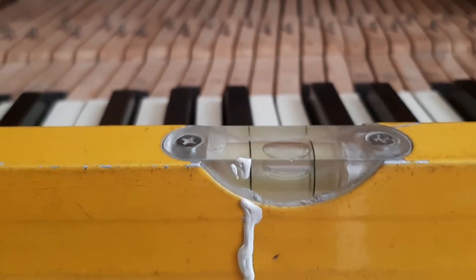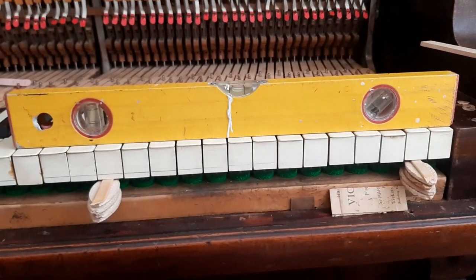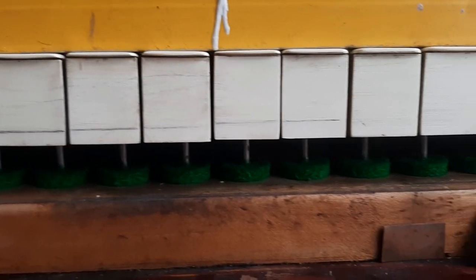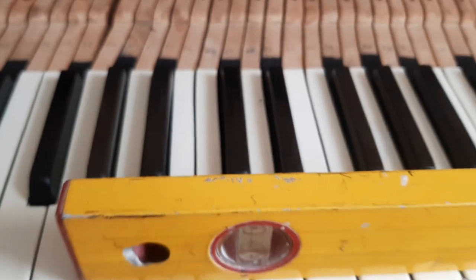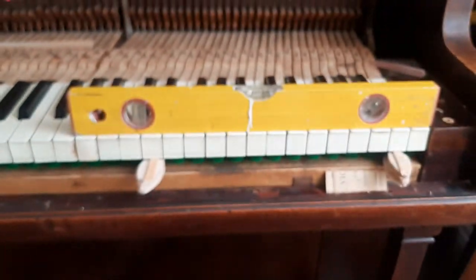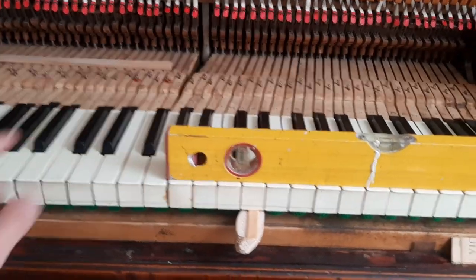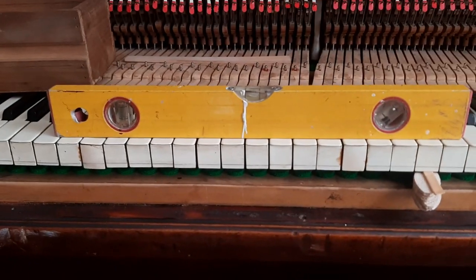So when it's on those two, it's not smack in the middle, but it's still between the two lines there. So after the first leveling and much more accurate process, you can see I've got them all perfectly aligned. That's the first about 20, and then what I'm going to do is leave this one in here and then put this in another key, for the length, and proceed like so, and then balance them, and then carry on to the rest.